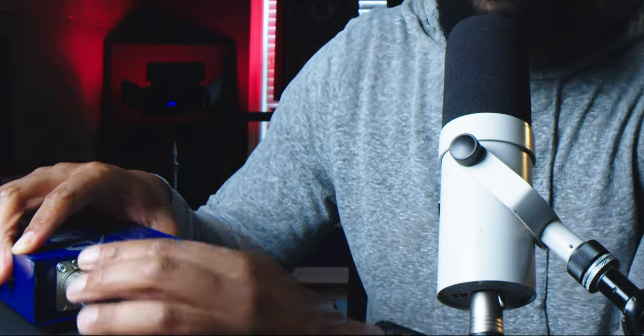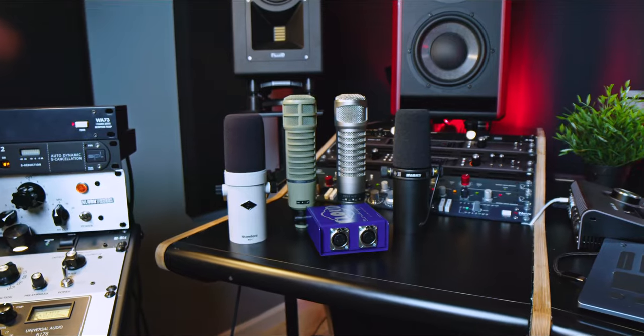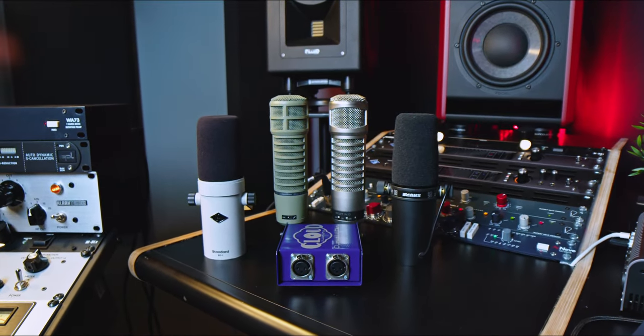Tools like this are really important for home studios, podcast studios, and voiceover studios because it's not complicated. You simply take your microphone — like the Universal Audio SD-1 here — take the XLR out and go directly into the CL2 at the front, then out of that into your audio interface, like my UA Apollo X4. Or if you have a Twin, go directly into one of the channels, select microphone, and activate your phantom power. The CL2 turns any microphone preamp into a ribbon pre, and it's really lightweight and portable — perfect if you're on the road.